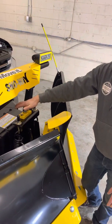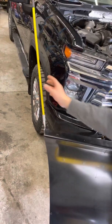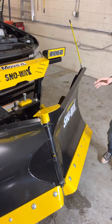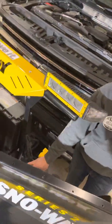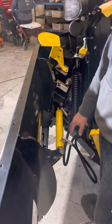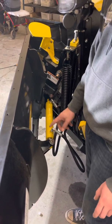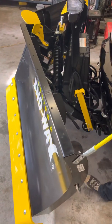The top pin is for leveling so that you have true level when you come down to your markers, which are directly in line with the bottom end of the scraper edge. This bolt right here is what levels that — makes it straight up and down. We leveled that, hit it with Loctite, everything's been Loctited on this unit. We used anti-seize on all the cylinders — the direct drive hydraulic cylinders from the remote switch — because if you've ever had to replace seals after salting, rusting, and water, you know how much of a pain that is. Everything's anti-seize, all bolts received Loctite, and we re-torqued everything.